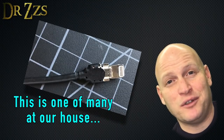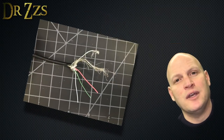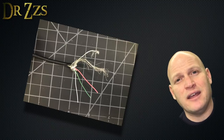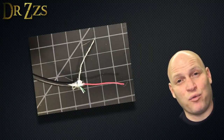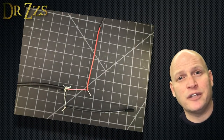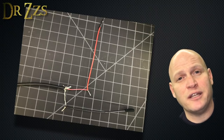Now most likely you've got some kind of a broken USB cable around your house. We're going to use a USB cable to power the Sonoff. Cut the cable to get to the wires. The red wire is the positive, and the unshielded wire and the metal sheath around the rest of the wires are the ground, and that's all you need. Connect the red wires to a jumper that you're going to use on the positive terminal, and connect the ground wires to another jumper to use on the negative terminal.